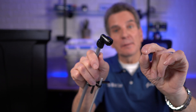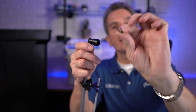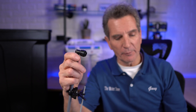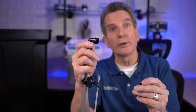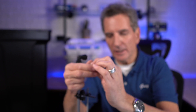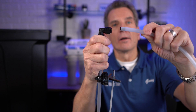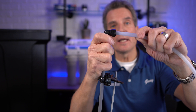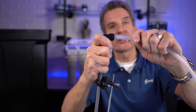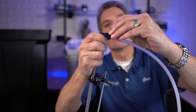You need to pull that C-clip out. This fitting is like a quick connect fitting — a John Guest type fitting. Once you pull that out, the fitting is wrapped in tape when you first get it, and inside there's an insert called a poly insert. That poly insert needs to go into the 3/8 inch tubing — you slide it inside. Then with the poly insert inside the tubing, you slide the whole thing into the fitting. You'll feel some resistance but you're not done yet — push harder until you drive it home, it'll go in about another quarter inch. Then use the C-clip to connect it.